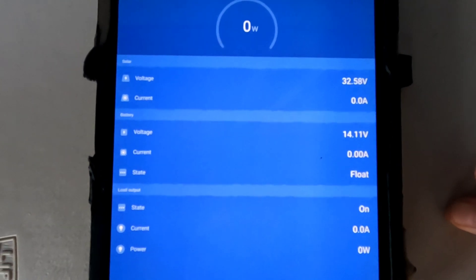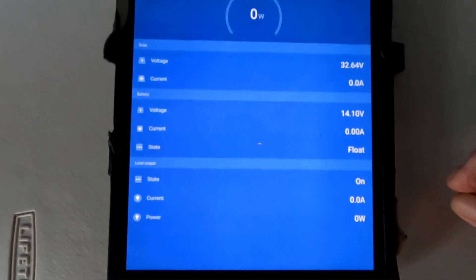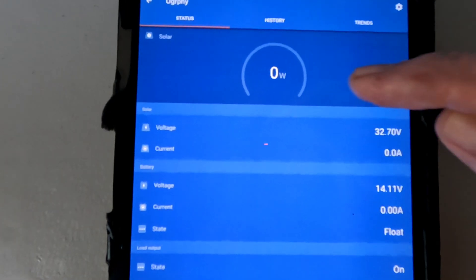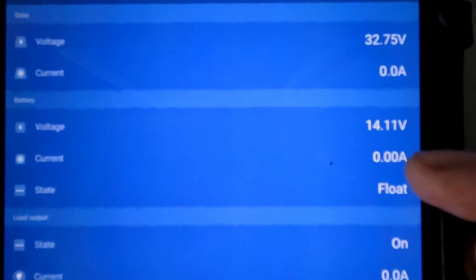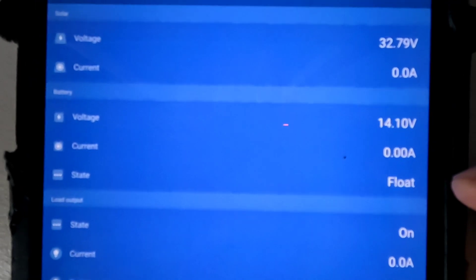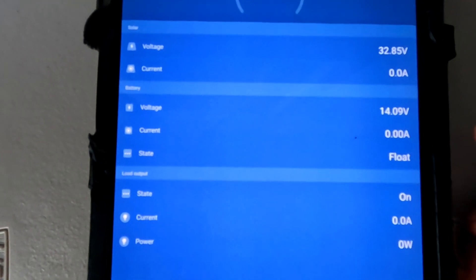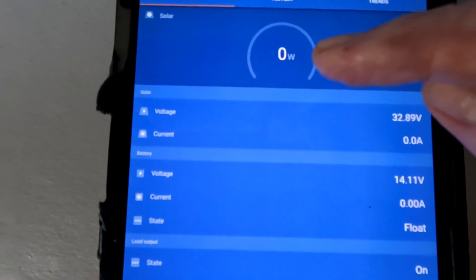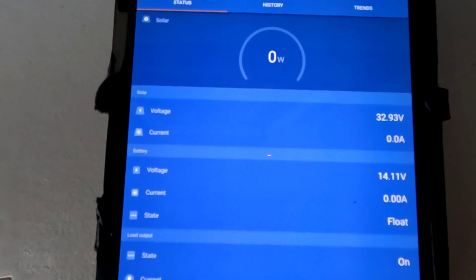This battery could actually be pulled out now. I have another battery I can switch in that needs a charge, so I'm going to take that TimeUSB battery out since it's not going to receive a single watt of charge and it's never going to dip down below 13.69 again overnight. It's 100% full and doesn't really need to be sitting on the charger anymore — unless I was going to engage it in some kind of discharging use, like turning the inverter on and running loads, where it would open up the panels once it got below 13.5 and allow the wattage to hold it there.